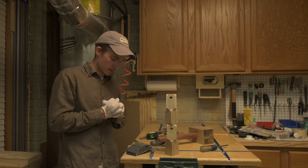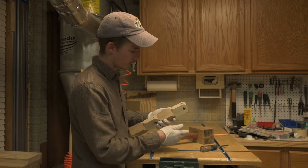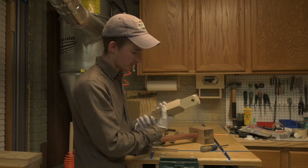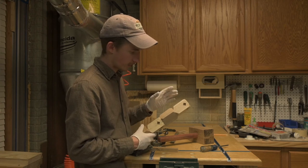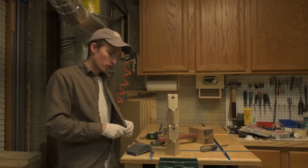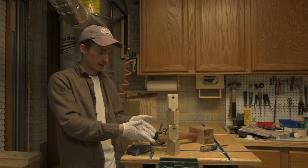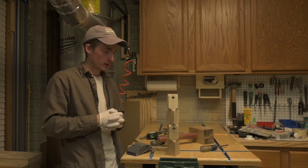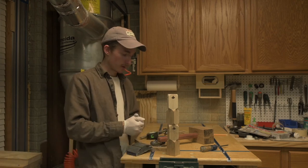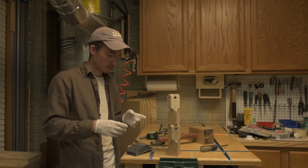I'm sanding with gloves on because my hands tend to sweat a lot, and I don't want the sweat and oils from my hands to get onto the wood and stain it. This piece looks a lot darker and more yellow than the other one because I've been constantly working with it bare-handed. It probably would have been smarter to cut all the mortises before assembling the four pieces together so I could individually sand each piece, but you live and learn. Next time I'll sand, cut all the mortises, and maybe even do sub-assemblies before the final glue-up.